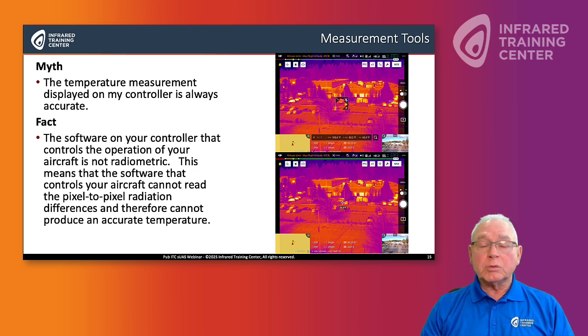software. So one of the questions we get, what do you mean? I have a radiometric camera. What do you mean the temperature's not right? Your camera's doing the job. It's a radiometric camera. It's capturing all the information correctly. Now we need to complete that by using a radiometric software to interpret that data and give you accuracy. So you might consider using FLIR Thermal Studio to interpret that, or a radiometric software to interpret your data for